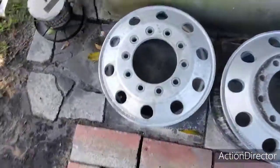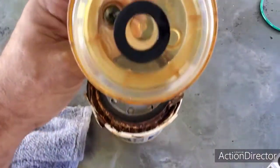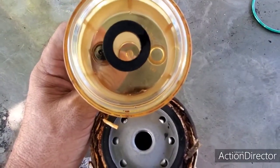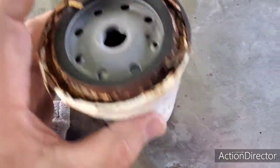Lucky enough I looked at this beforehand. I want you guys to look at this real quick — look at the fuel separator. This is not an old fuel separator because when I bring up the bowl it's not dirty at all, so the fuel inside the tank is not dirty. But the actual separator, as you can see, I guess some salt water got in there and rusted it out.